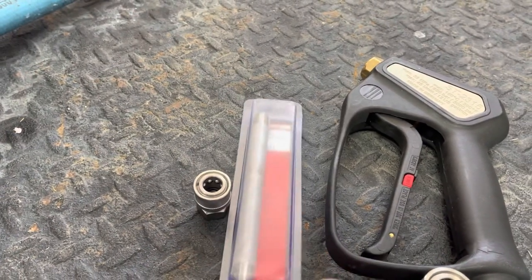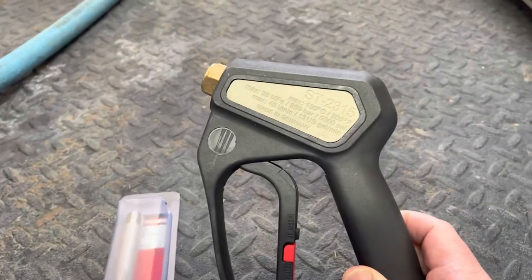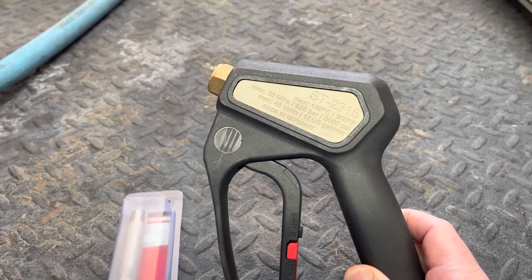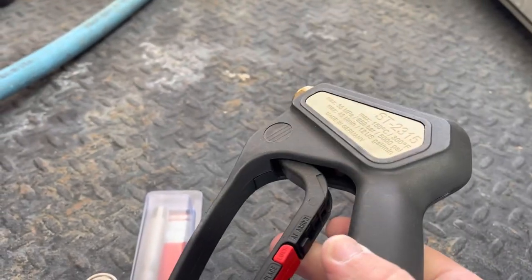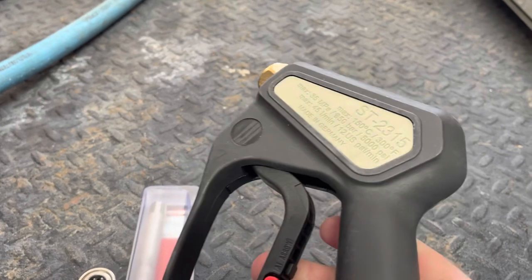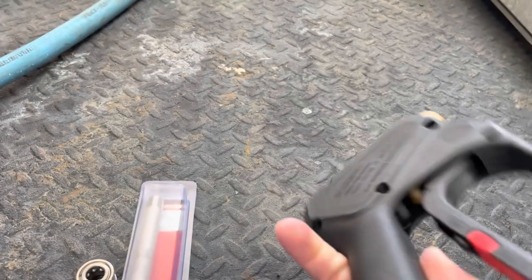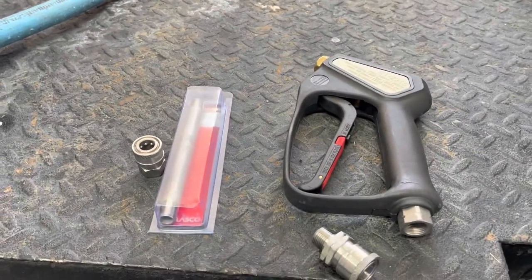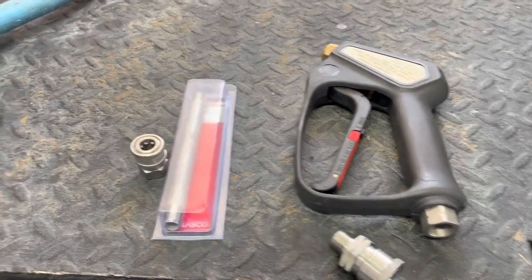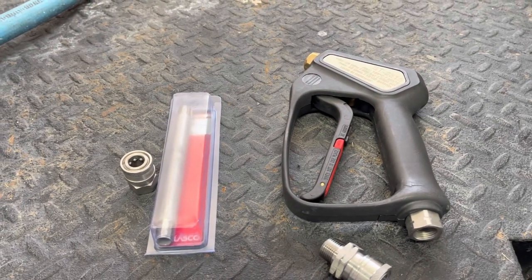And lastly, the gun. I've tried a bunch of other guns and this one seems to last the longest. This is the ST2315 Easy Pull. There are a couple of other ones that say Easy Pull, but what makes this one a little bit different is it has a ceramic ball in it, so it's not going to corrode as fast if you're downstreaming or running other chemicals through your gun. So this would be my ultimate house washing gun — put this together with a J-rod or an M5 twist and it's going to get the distance that I need.